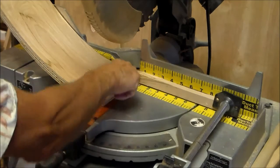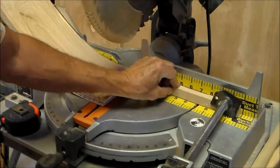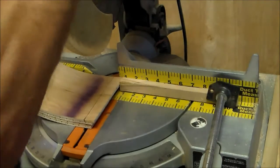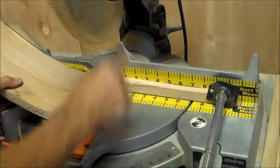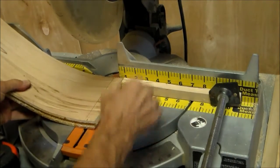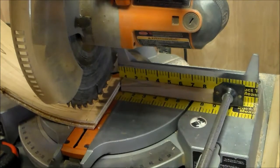Right here you can see I'm holding this from sliding with a stop, and I can move the stop easily — I have it connected and just leaning up against there as a stop for the piece. That will hold it in position while I'm cutting. Each reference line is going to be slightly different, so the stop block is going to have to be adjusted for each individual cut.